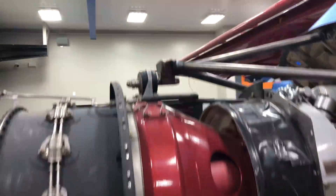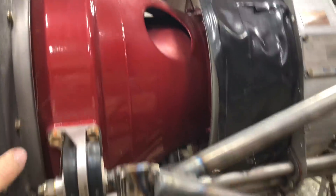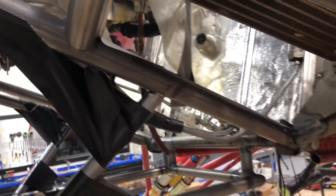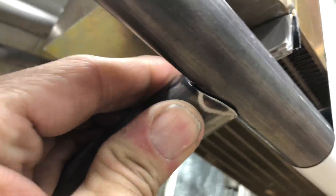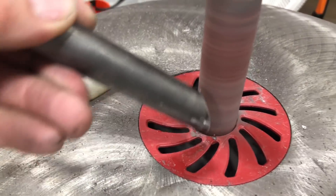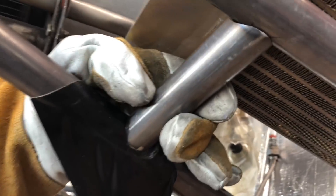My motor mount is getting really close. Got most of the pipes done, it's hanging on its own, and down to some of the fine-tuned brackets. Down here I got to weld this up - this is my battery tray. Right up here I got my oil cooler. I got this one ready to weld - that one I got fitted really nice. This one, not as nice - I don't like this gap right there. I can probably pinch it in and weld it, but I'm going to sand it a little more. It doesn't want to fall into place. Now I've got a really nice tight fit - I'm almost there.